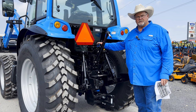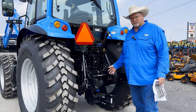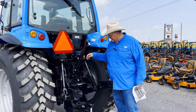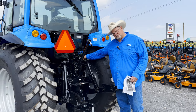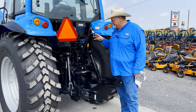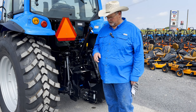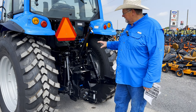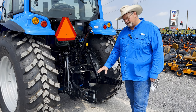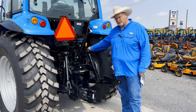The remotes on this tractor can only come with two remotes instead of the three remotes I've seen in the past, like on my 573. A lot of the back of this tractor is just like the 573 that I own. It does come with the external lift for the three-point hitch. Whenever you're hooking up implements, you can lift or lower with this handle right here. This tractor is on a large frame and it does come with a very hefty drawbar. It has draft control, screw-type adjustable link arms, heavy-duty drawbar, and heavy-duty three-point hitch — two remotes. Very impressive.